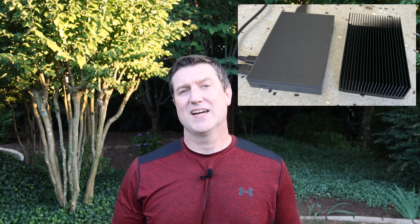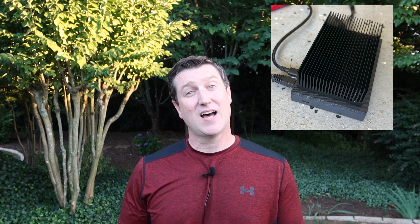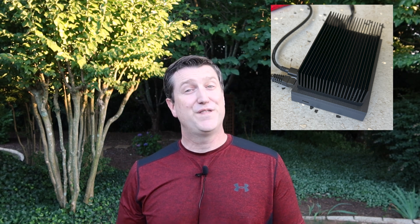After my test trial runs, and before I ran the formal final test, I went on Amazon and purchased an aluminum heatsink that was roughly the size of the Quieter 3 — an aluminum fin-based heatsink design, which only cost me around $13 US dollars. Typically when you apply a heatsink you'd use thermal paste or thermal glue, but in my test I only placed the heatsink on top — I literally just set it there. Heat always flows from higher temperatures to lower temperatures, so the heat leaving the box went into the base of the heatsink, then radiated out through the thin fins, giving us much more surface area to dissipate heat into the surrounding air.